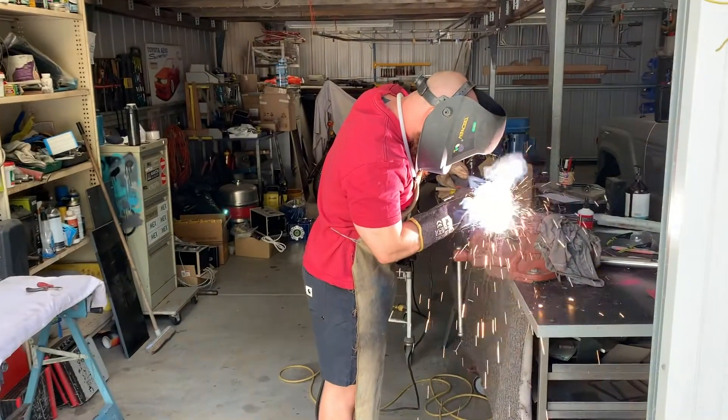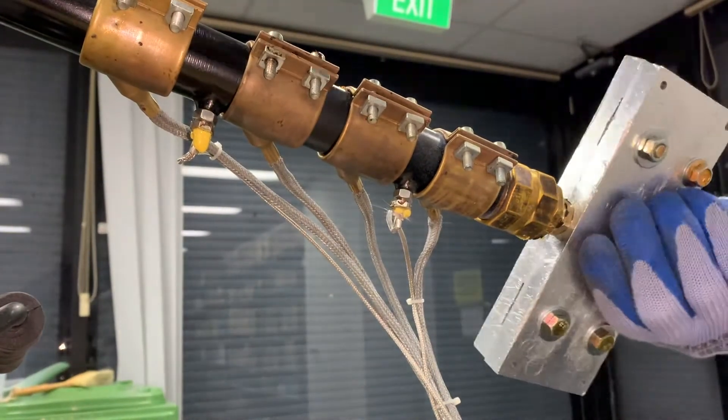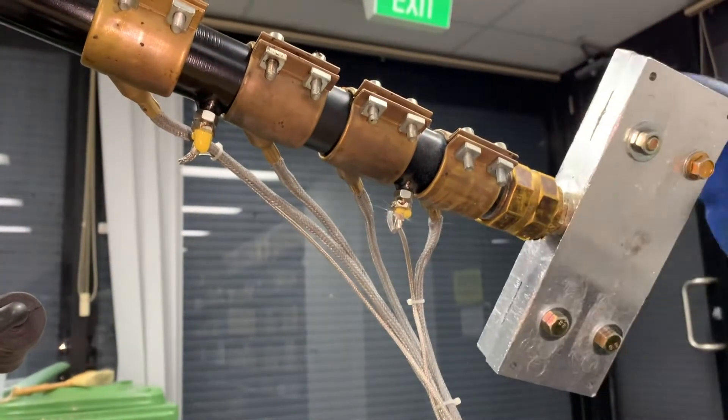Pierce came to me with two goals in mind: increasing automation so there's less strain on your body. If you're making parts all day, using a manual injector does take a lot more force, especially if you have bigger parts that have further distance for the plastic to travel. Depending on the part design, the distance that the plastic has to travel down the mould will determine the amount of pressure required to push the plastic. If you have a manual injector, this force can be quite high.